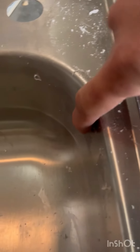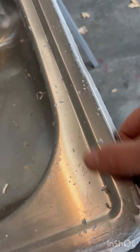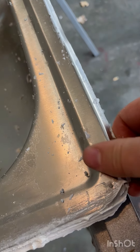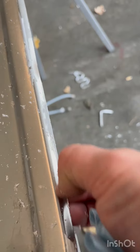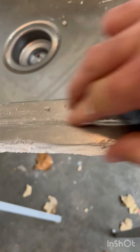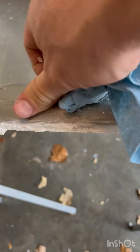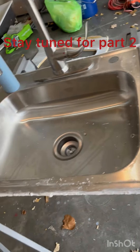It's actually on the inside of the sink here. This is an extreme example of what not to do, but I do see this done on a lesser level all the time — people caulking against a sink or countertop where they over-spread the silicone at a very thin level on the surface. What happens is that light layer of silicone actually comes off just like this over time, and then water gets underneath what's left and you get black mold against your shower or sink. Here I'm using just a paper towel and my fingers to get this off — no abrasives. It doesn't take much, but it will come off with a little elbow grease.